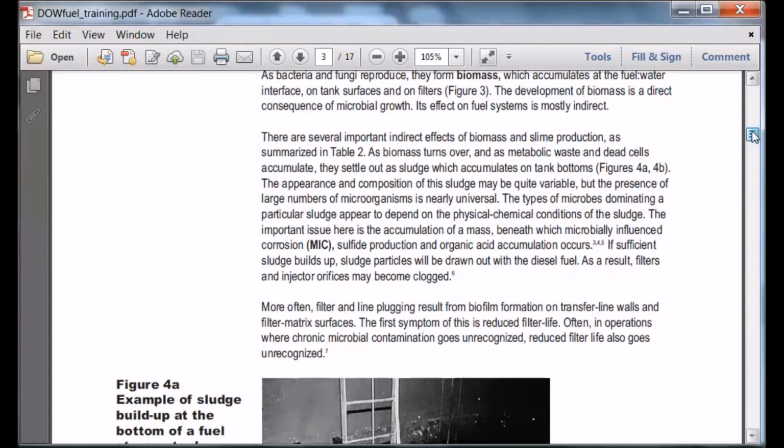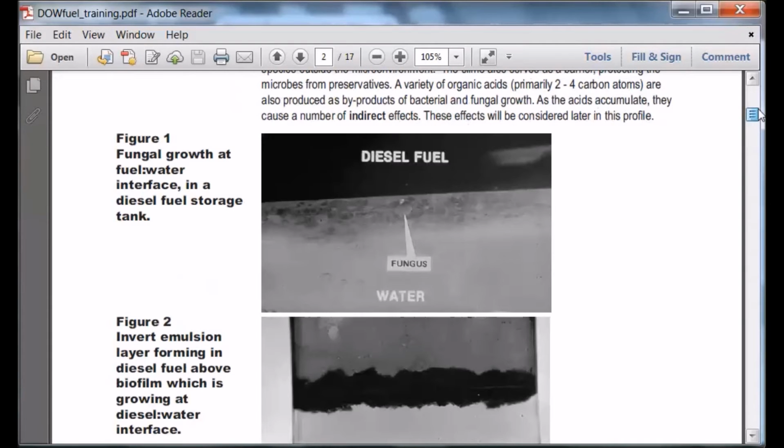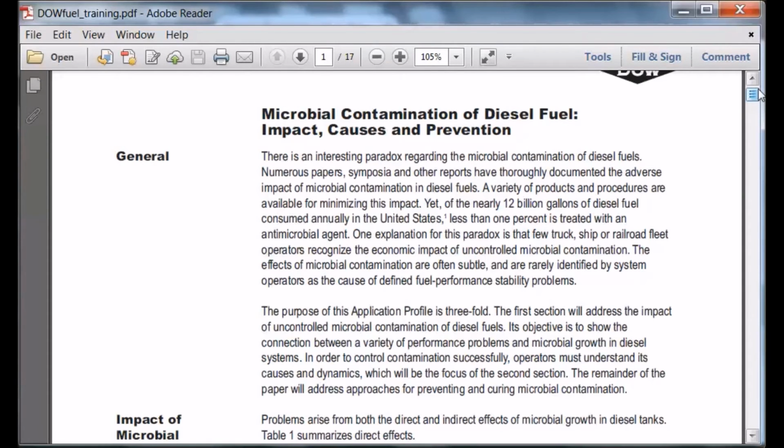So bottom line is that I know what it is, and I know what caused it. I will show you a little bit of the picture showing the fuel pickup is above the bottom of the tank by an inch. So if there is water in the tank, there's always going to be an inch of water in the tank. It's a perfect environment for growing this nasty stuff. It's just one of those FYIs.